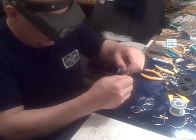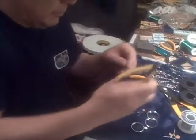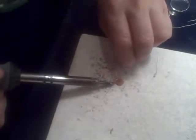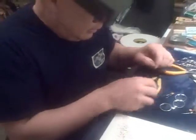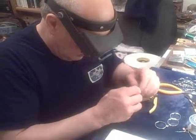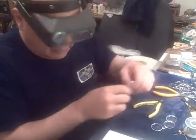I'm wrapping the 221 capacitor, and it's got this funny kind of shape to it — like a long-armed person with troubles. I'm going to take this and linearize it by trimming off those leads. Then I'm going to solder this in real nice. I like a real good solder connection. That's hot as hell. Then I'm going to take another one of my 47K resistors and put my 151 capacitor around that, and take those leads off.